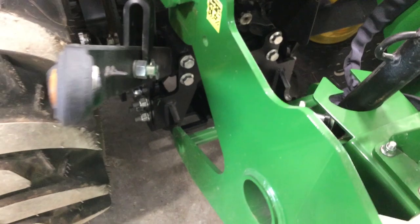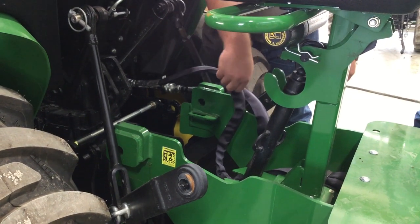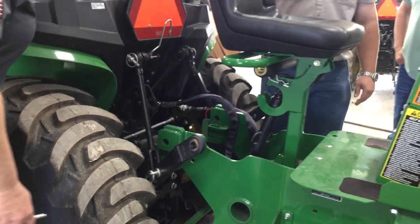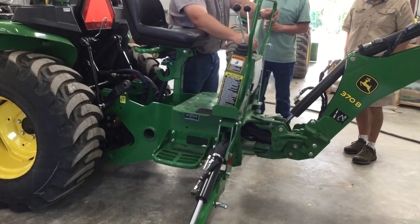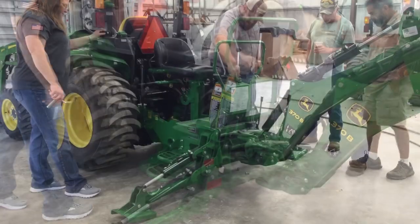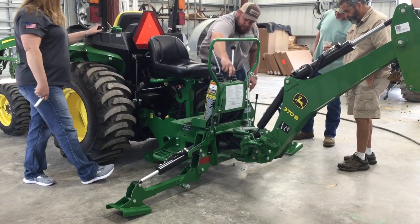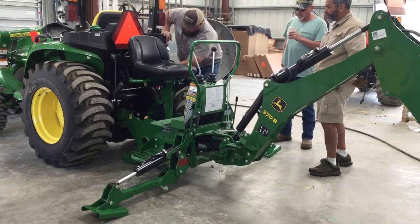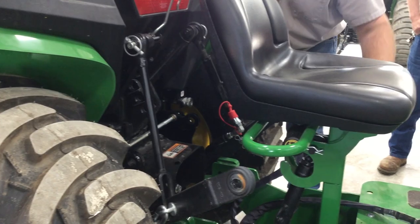At this point you can kill your tractor. This will be your hydraulic lines right here — this is your power line and that's your tank line. You'll take your legs and just play with each one real slow, a little at a time. You'll just keep on playing with it until the front tip hits the ground. Play with your hydraulic so all your pressure's off your lines. Clip this in, pull out — that one the same, clip in, pull out.